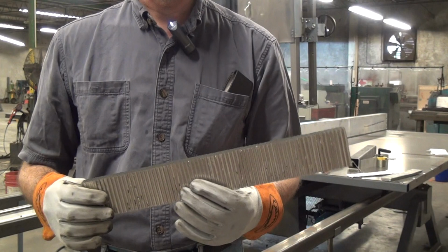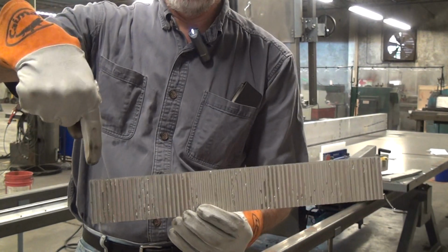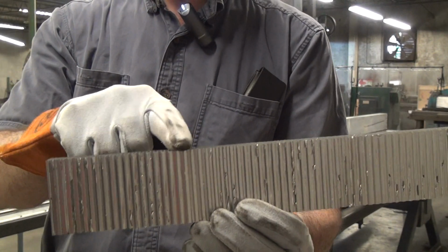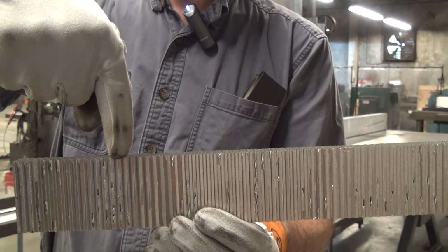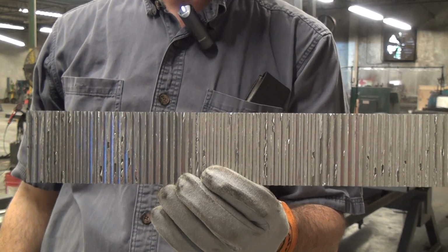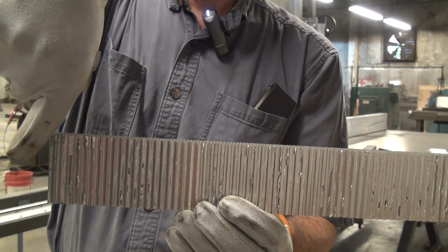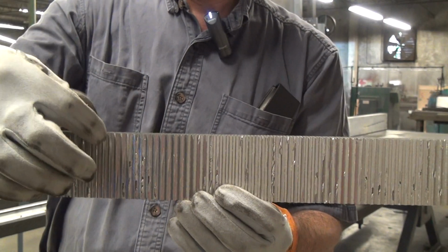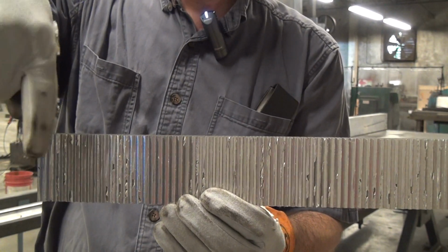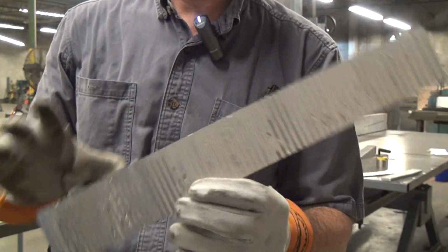Now the idea behind having the blade tilted is if the blade is, my finger's the blade, pretend please. If the blade is moving like this vertically, as it cuts through these cells, the blade is seeing a solid wall of material, then nothing, then a solid wall of material, then nothing. And so it can lead to a weird jaggedy cut. By tilting the blade forward 5 degrees as it cuts, it's cutting through lots of little thin sheets at a bit of an angle. Instead of just hitting solid material, nothing, solid material, nothing, by sweeping it through at a bit of an angle, we get a smoother cut on the material.